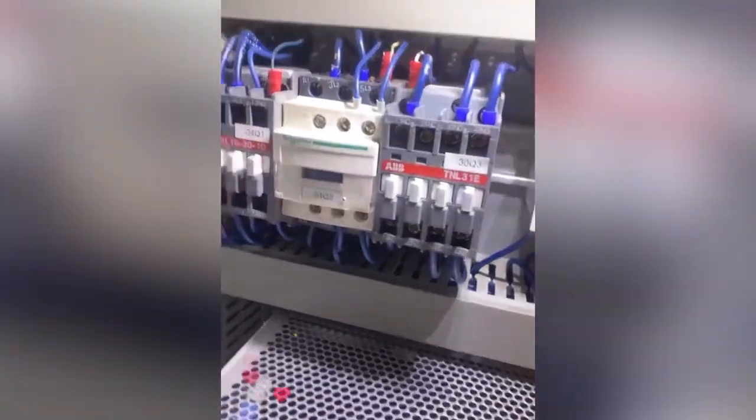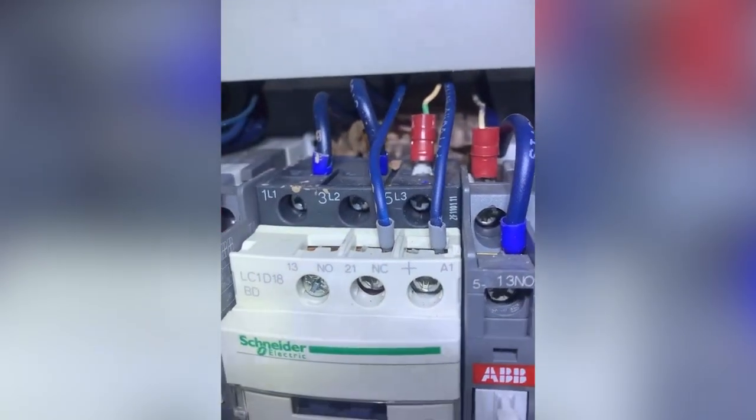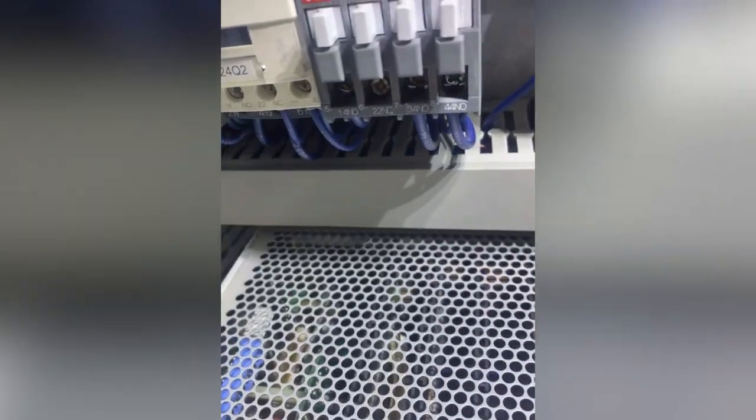Back here on this E-stop fault, after I found this dodgy contactor. If you look in there, look, you can see that little nest, which I'm going to deal with now. So I'm going to get that nest out, isolate this, change that contactor, see if it makes a difference. But there's definitely a dodgy nest in there. I'm going to get it out. But what I'm going to do is protect the top of this computer, because otherwise it'll all end up in there and I'll be in even more trouble. I've covered that up so nothing can get in there.